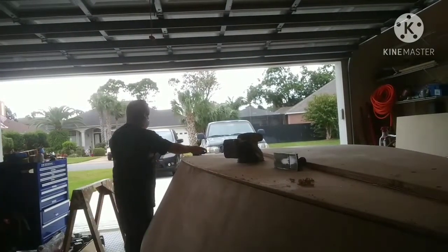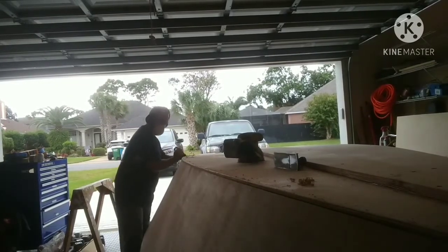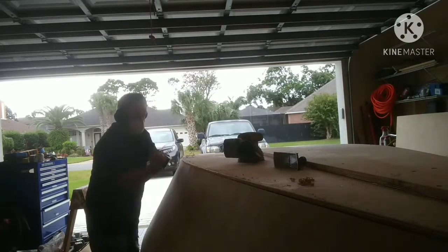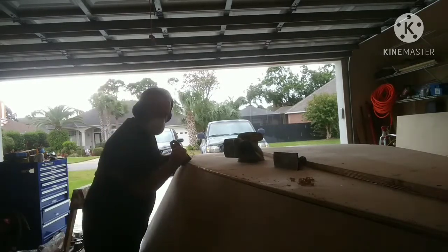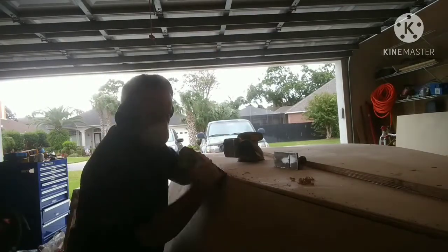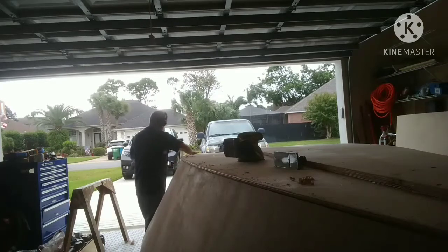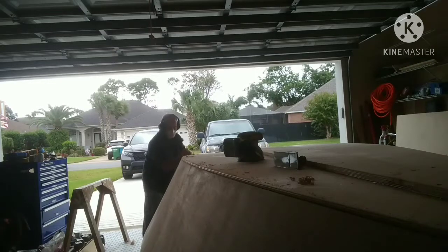I got a new tool which you can see on top of the boat there, which is a DeWalt cordless sander. And I started sanding with 80 grit paper, but soon realized that there's probably about 70 feet of curve that I need to make here, over these corners. And went in and grabbed my planes, a number 5 standard, to take off the majority of the wood so that I can get a nice fair curve. Just lay it over, and then back to some sand.